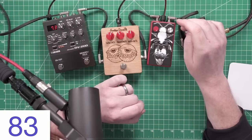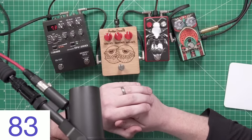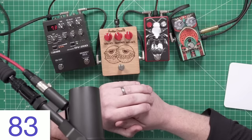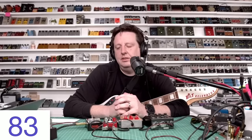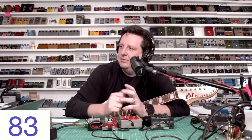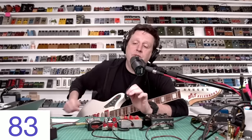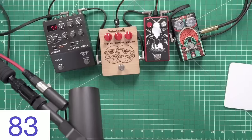The MXR Hybrid Fuzz, $169.99, combines two fuzz face sounds. There is one silicon transistor and one germanium transistor. A fuzz face has two transistors. In this technique Q1 is silicon, Q2 is germanium. It's more stable, kind of does the raspy, but also the smooth. It's my favorite type of fuzz face circuit, and it's designed by George Tripps, of Way Huge, DL4, all that stuff. Brilliant designer. He really is great at fuzz. That's it. All right, play 'em.